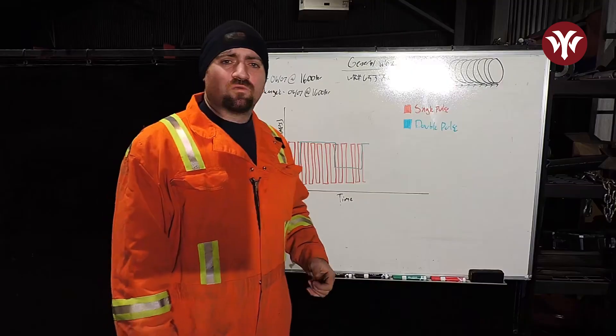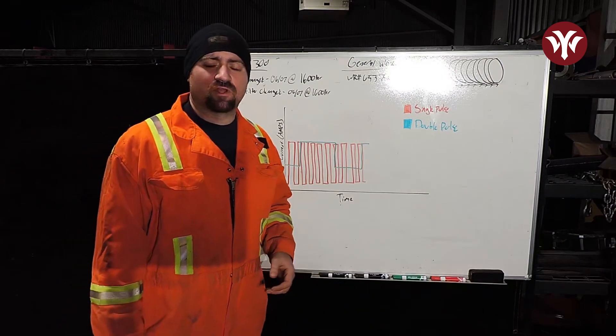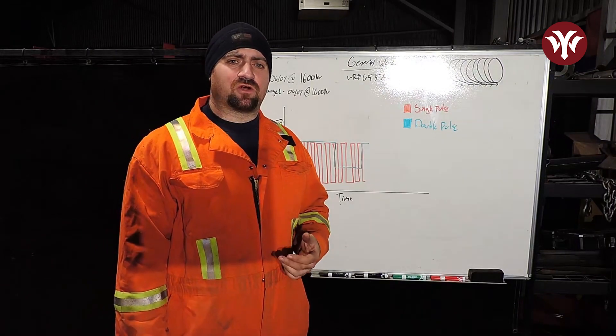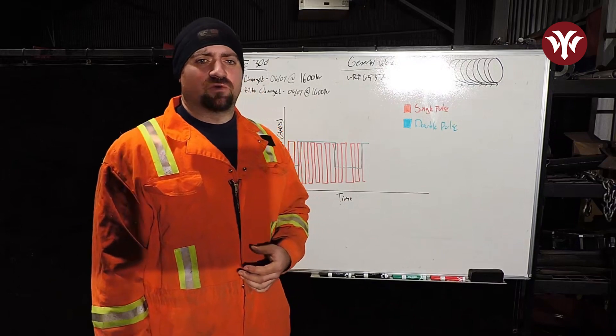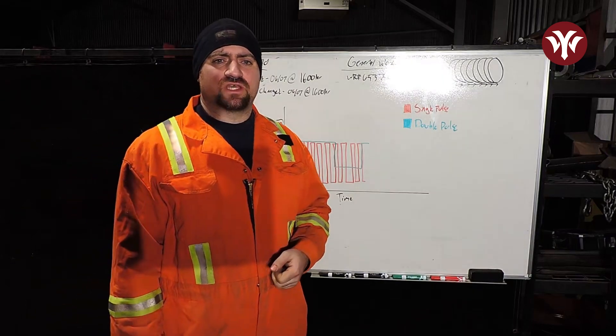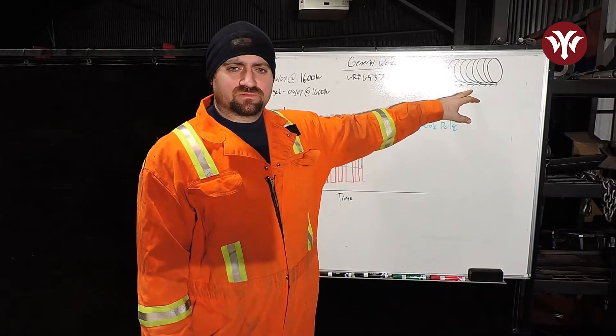So now let's jump into these settings — there's a lot to cover here. The YWM211P is a multi-process machine capable of the three most popular weld processes: GMAW, SMAW, and GTAW with a lift arc. This machine is optimized for pulse welding. Pulse MIG is different from the MIG styles you may be used to. What the single pulse settings do is reciprocate between a high current and a low current at a frequency of about 150 to 400 Hz depending on how high you have your amperage set. This breaks up any oxides left on the base material while also creating a fast-freeze style puddle. A fast-freeze puddle makes the puddle less watery, and as you move away from the puddle using a stepping or whipping motion, it freezes in place so you can leave a weld that resembles a nice stack of dimes — at least to a certain extent.